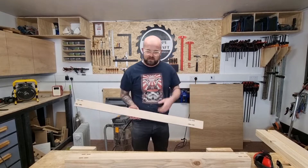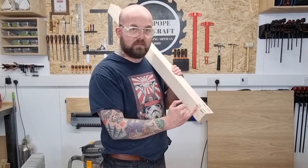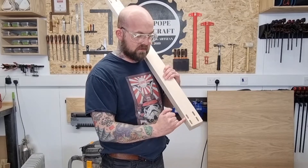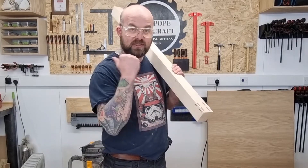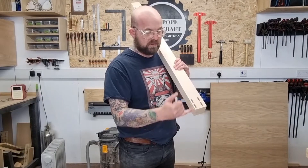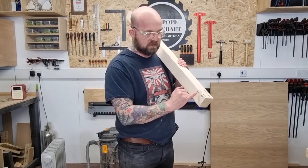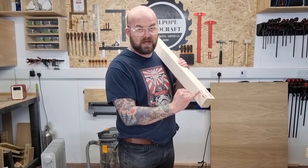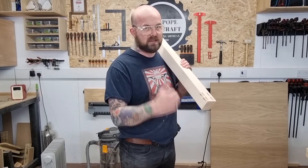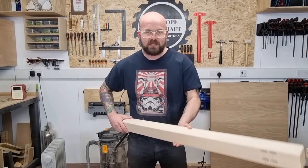Don't have a daydream while using a power tool. Worst case scenario, you cut your hand off. Best case scenario, you balls up and drill mortises where they shouldn't be - which is exactly what I've done. So now I've got to think of a solution. Luckily that's going to be at the back of the bed, so I'll attach everything normally and then towards the end of the build I'll chisel that bit out and put a little sliver of pine in there. It's the back of the bed against the wall so you won't see it.